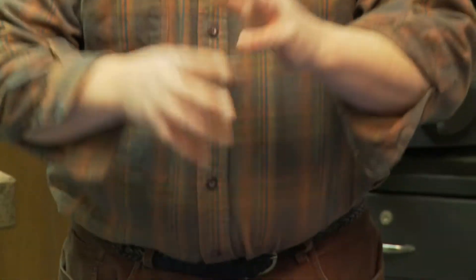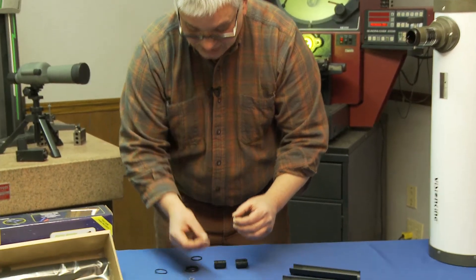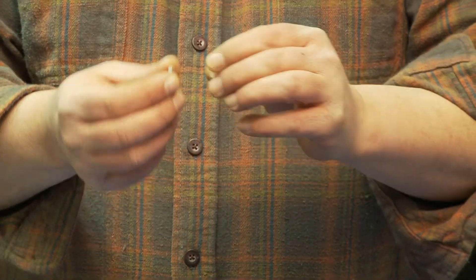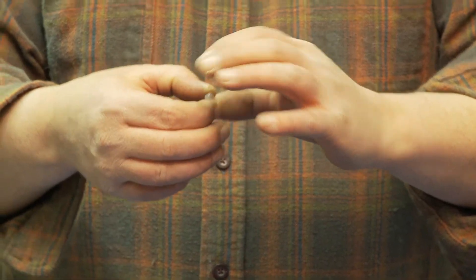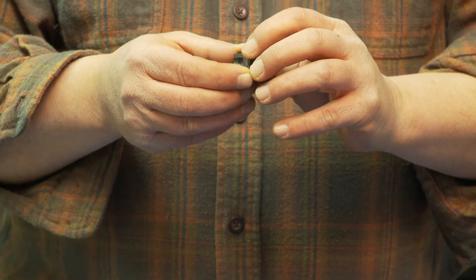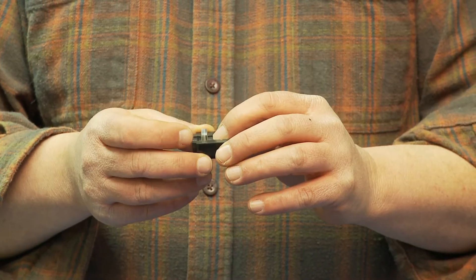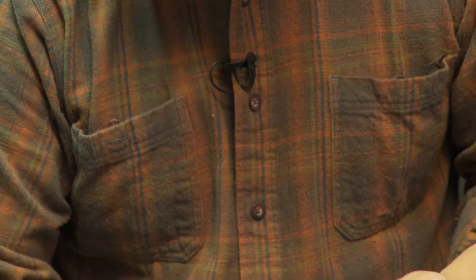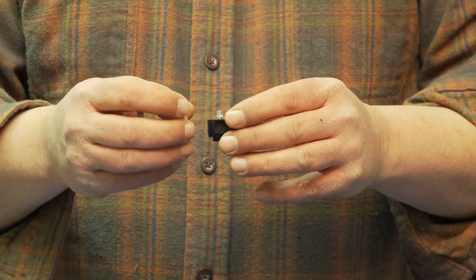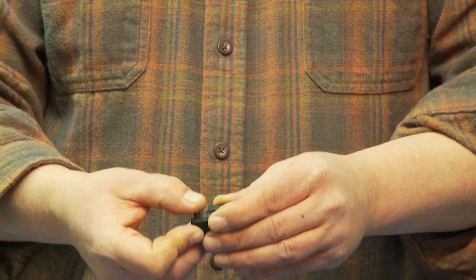What you're going to do is create your own Kellner lens. It comes with three lenses, and the lenses are numbered. As with all lenses, they go concave to convex — they just slide together into a slot. So you have your concave, flat, and then convex. Since this is a three-piece Kellner, you get another lens that's flat on one side and convex, and the convex side goes against the convex side of your other assembly — and it just snaps right in.